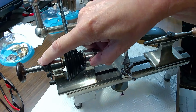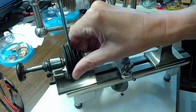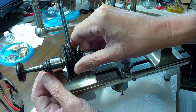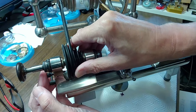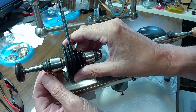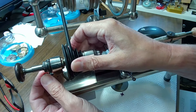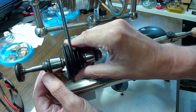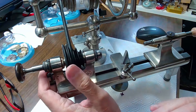Then you've got the lathe pulley — this thing here is the lathe pulley and it has a pin to lock it. That's for positioning the lathe: if you're making a watch stem, you'd be cutting the stem and every 90 degrees you'd turn it another 90 or 180 degrees to cut the other side using files. So you have three or four different positions and you can lock it in at those positions.